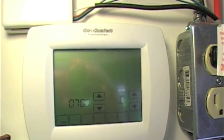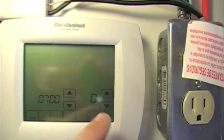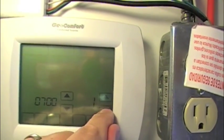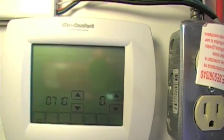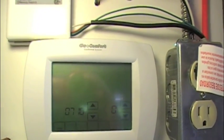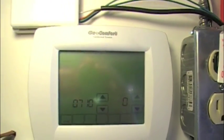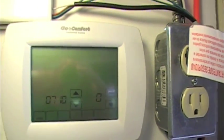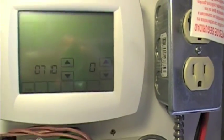Item 700 is temperature display offset — we can decide if we want the display readout to be higher or lower than what the room actually is. Item 710 is the reset: zero means no reset, and if we select one and hit Done, it will reset all the options.